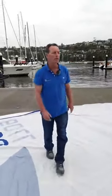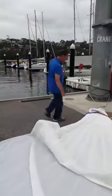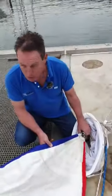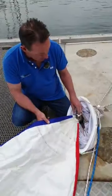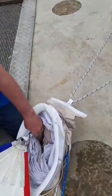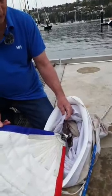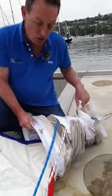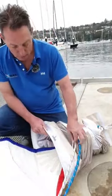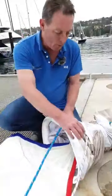I'm just going to walk up to the top of the sail here at Glorious Middle Harbour. We've shackled the sail on and got it ready — I've put tape around the shackle pin and used a spanner to tighten it so it won't come off. How this works is a webbing strap comes from the top — the same strap I've tied to the crane — and that strap takes all the load. The sock is made of about two and a half ounce nylon fabric, and there's a rope that runs the entire length down to the deck, goes up through a pulley, and back down again. On the downstroke, the two strings pull it and the spinnaker snuffs up through the fibreglass hoop.